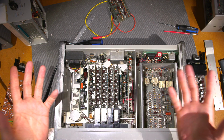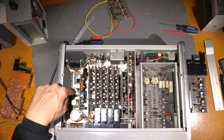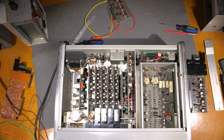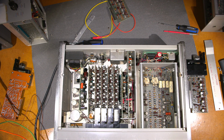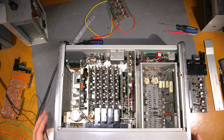And it's very easy to come across. If these capacitors weren't shielded, that would be horrible to come across those caps, because this is positive and negative 150 volts for this unit to run the Nixies. And this here's a lower voltage supply, about 40 some odd volts is across that cap. So whenever you're working on something like this, you always have to keep that in mind. These things are loaded with high voltage.